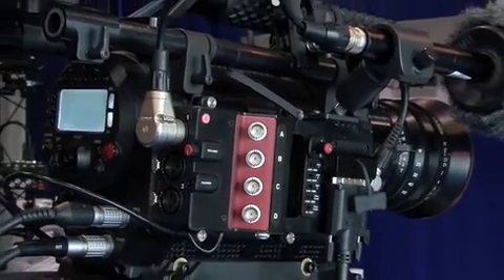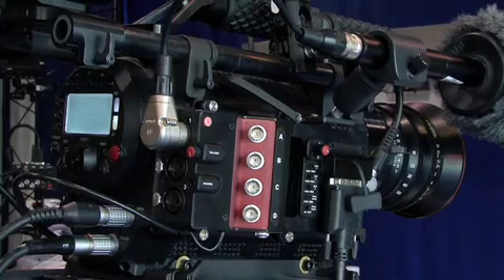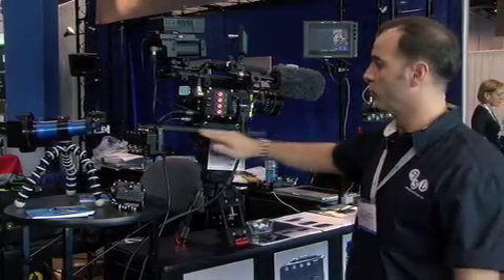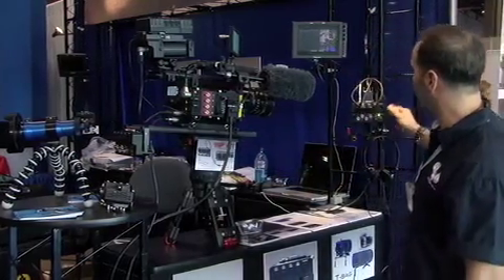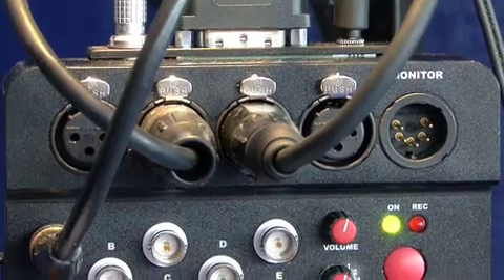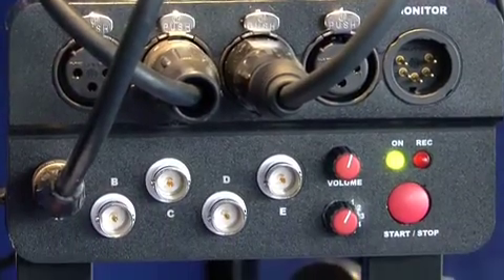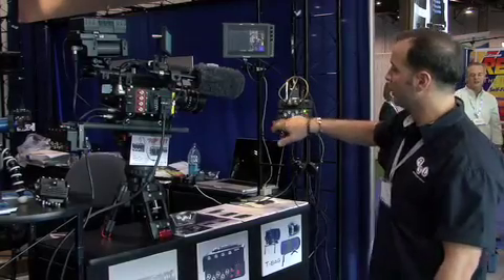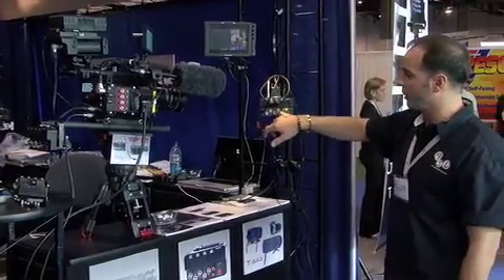By converting it to full-size connectors, at the same time in the electronics we can send all the inputs and outputs, Genlock, and timecode as well down this DVI pipeline, which you can remote up to 50 feet away over to a breakout box. So ultimately one cable can take all your inputs and outputs, remote it away to a breakout box where you have your video, your Genlock, and your timecode in and out.